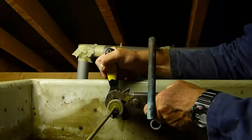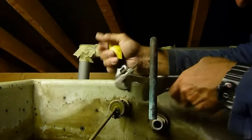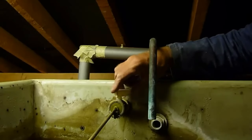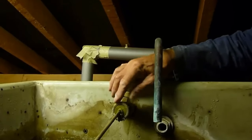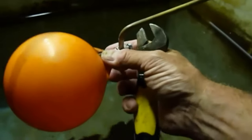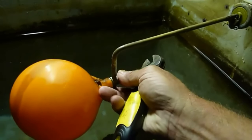It's grabbed it now. Make sure it's nice and level — get the ball cock dead level and do it up. Then put the spout back in, being careful not to cross-thread it, which is very easy to do. Once you tighten that up, the next part is to tighten the ball on the arm. Get the level right — fairly low down on these arms — and then tighten it up.